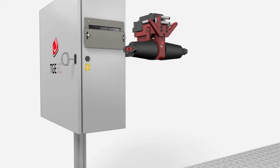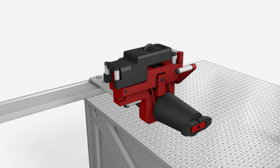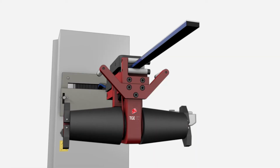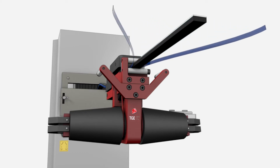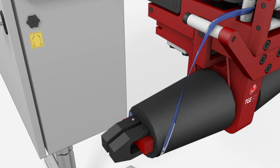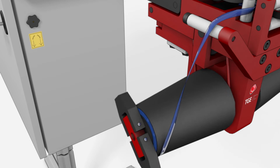The liner remover peels off the Thermoflex side tape liner to reveal its adhesive sides. Feed the Thermoflex through the liner remover, allowing approximately 30 centimeters to pass through. Gently peel back the blue liner on both sides of the spacer bar. Then pass it on each side around the small vertical roller, down over the horizontal roller, and around the liner remover's main spool. Make sure it is securely held by the side clamps on the liner remover.